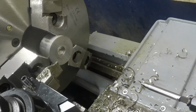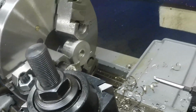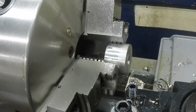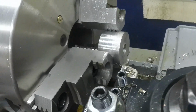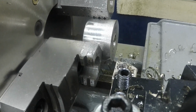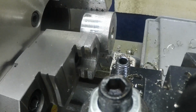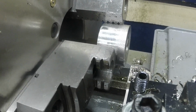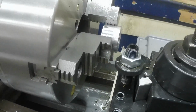Okay, we didn't lose too much material there. I got, well, I just need one more for the larger sizes. And the smaller sizes, I could probably go to 1-inch diameter and use my collet, a 1-inch collet holder, and I can utilize, get a lot more yield out of that. With better holding power, I can have a little more stick out, I think.